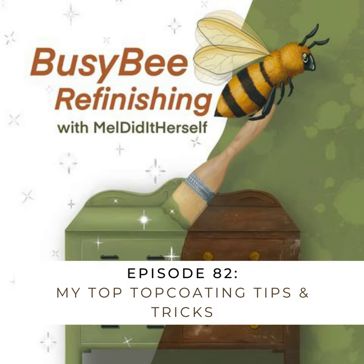I clean and reuse foam rollers multiple times, unless I'm using an oil-based product, in which case I'll toss it. I've heard people say to wet your rollers before using them, but I do not wet mine. If a roller is still a little damp from previous use I'll grab a new dry one — because I've had moisture come to the surface and integrate into the top coat, making it bubbly and giving it a weird look. So: dry rollers only.